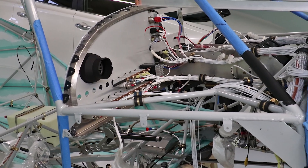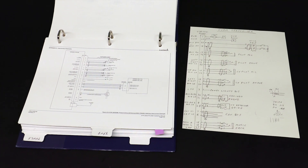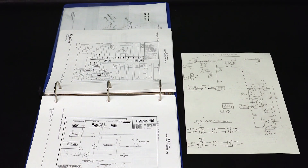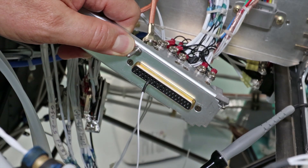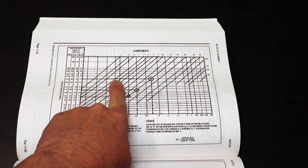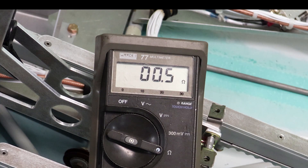While I still had easy access to the wiring harness it was a good time to ring out all the wires, or at least everything except the engine harness. I referred back to the installation manuals for the connections, checking them against my drawings as a double check to ensure I hadn't made any mistakes. And it was fortunate that I did, as I discovered I had made an error when transposing the Rotax power connections to my drawings — that's why we check. I rang out the wire connections all the way back to the circuit breakers and single-point grounding block, including the G3X display wires and the servo wires. I always set the meter to measure resistance so I can see if there is any excessive resistance in the wires or connectors, because using just the beeping function of a continuity checker doesn't reveal if the resistance is excessive. The actual maximum resistance or voltage drop depends on the length of the run as found in the charts in the AC43.13. The runs are very short in my airplane so the resistance should be less than one ohm, with most of that being the meter leads.